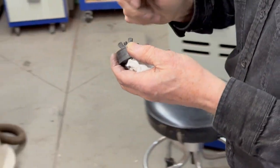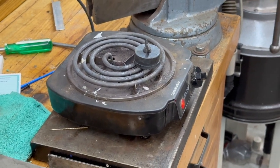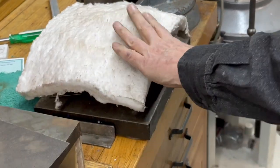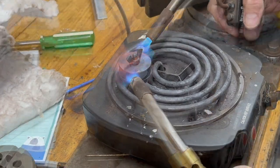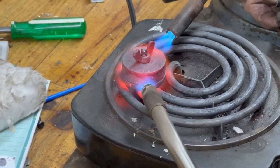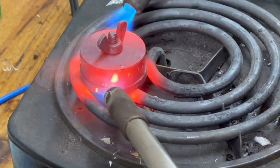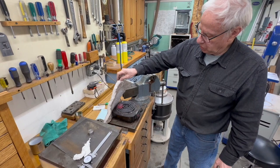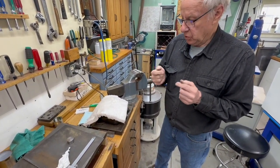What I do is put this on a hot plate on high, then throw this little insulating blanket over top of it and let it get really hot. Then I'll heat it with the torch afterwards. I heat this up until the hot plate kicks off because it's overheated, then I heat it with a torch until I get it glowing red hot. It heats the rings up slowly so the whole ring heats up all the way around at exactly the same temperature. It works really good.